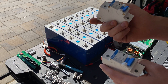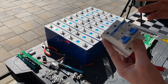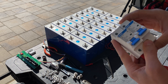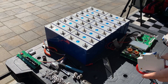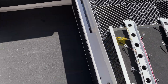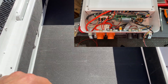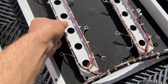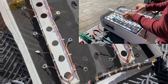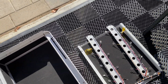I even purchased another identical circuit breaker on eBay and did my own test with 125-plus amps to see how it would work with disconnect — I was expecting it to burn, but you can see the results later in this video. Inside the battery compartment, everything has soft material so the cells are nicely secured and separated from the electronic parts. For terminals and temperature sensors we have two metal plates, and four temperature sensors installed on the cells. That's all about the internal components for this battery.